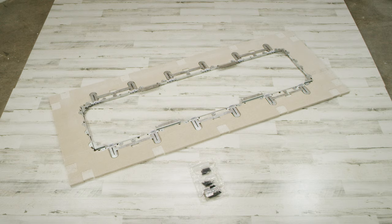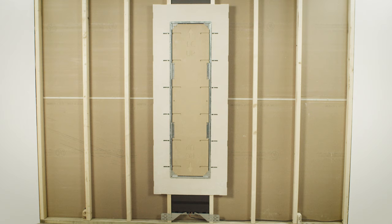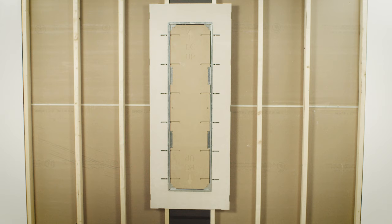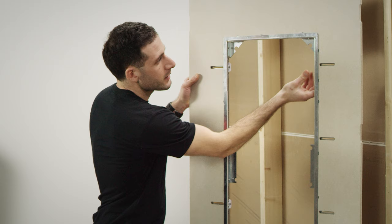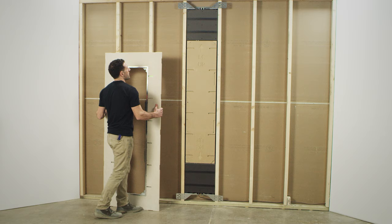The Statement 40XW includes a piece of premium wallboard known as fiber rock. This material is typically stronger and more consistent than traditional sheetrock. The purpose of this board is to ensure that any irregularities or inconsistencies in the wall construction do not interfere with the look of the final installation. Before putting the install board on the back box, check the standoff brackets — move the screw back and forth to see if the standoff bracket is moving. If you find one that's too tight, use a Phillips screwdriver and loosen it until it can move.